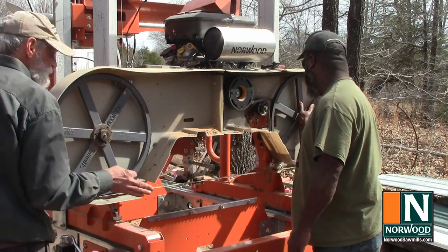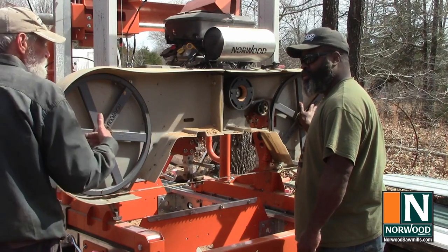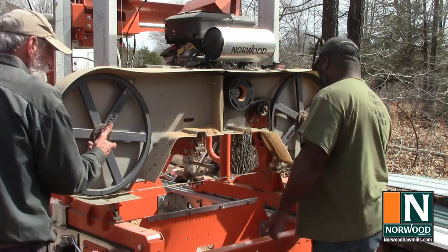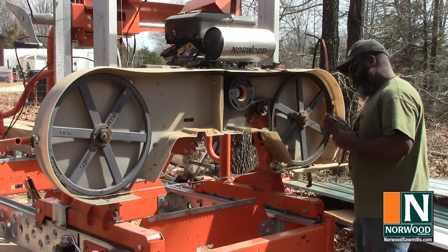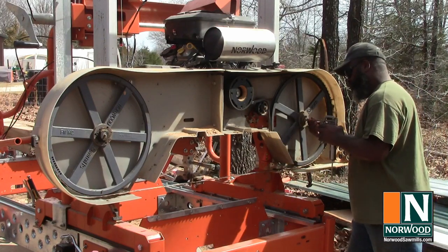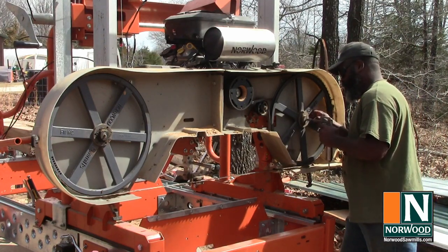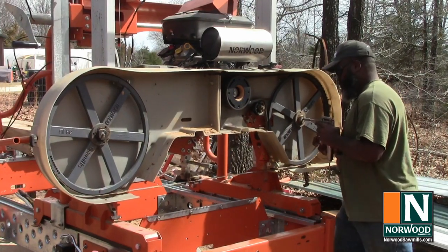In any case, they're not sealed bearings, and anytime I change the blade, it's usually a good time to give it a shot of grease. Okay. Yeah, that's good. Just a couple of squirts. It doesn't have to come gushing out. And that's a good kind of grease gun with the trigger. I like that better than the...